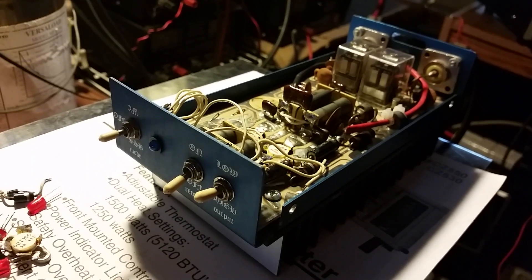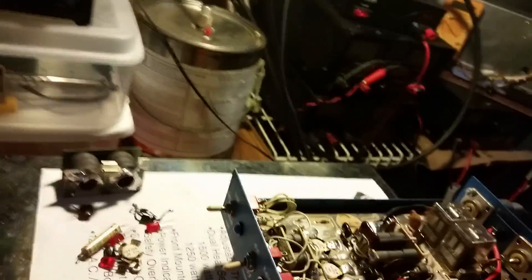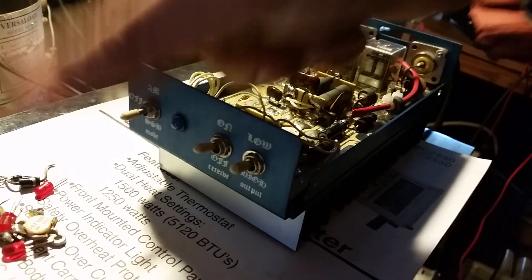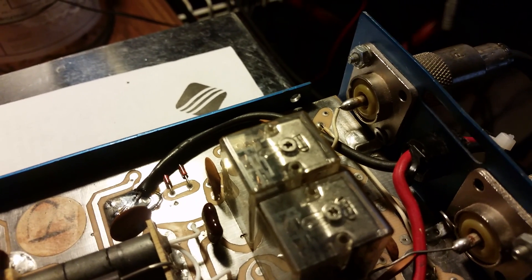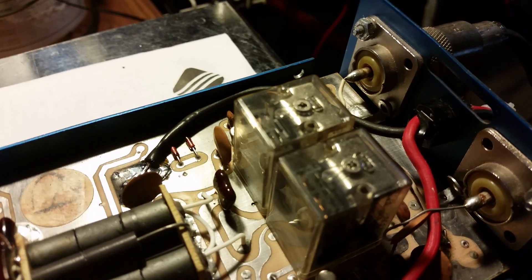That's pretty neat — got my son over here working on a little bit of circuitry. Good job buddy. Make sure you put that preamp board down, I need to use that. Put it in the radio — just don't put any fire on that thing. So it's got an invert circuit in it. The amp is turned off now — watch. You see the preamp relay actuating? Now watch me key the mic — see, it unactuates the preamp relay.